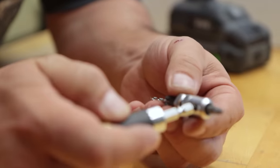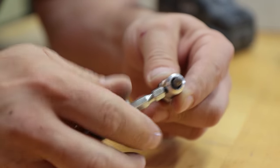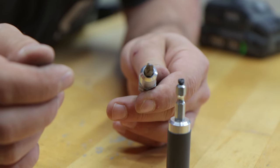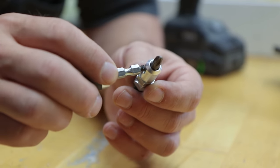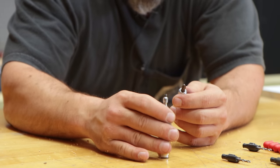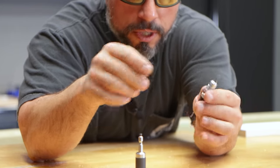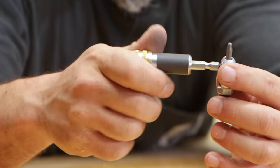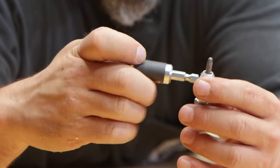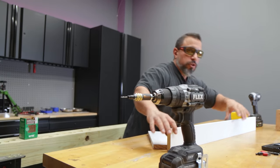Here's what you'd do — on the back end you have an Allen key required. Pop it in, back this off just enough to release the countersink. We're going to tighten that down — do not over-tighten per the instructions. Then we back out our drive and pop in our T20 drive bit. In all honesty, this is the way I'll most likely use this kit.